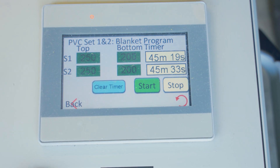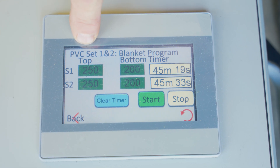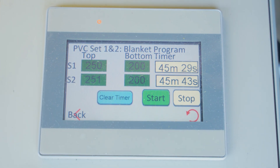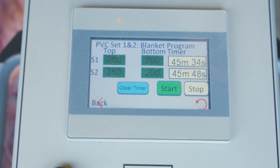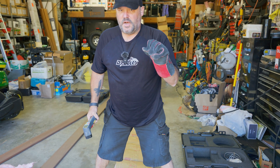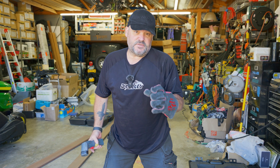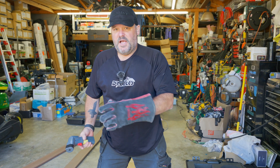I want to show you what the board is looking like. Let's take a digital thermometer and I'll show you the temperature fluctuations from the programmed temperatures to the actual temperatures on the deck board. You can see my top blankets one and two are set at 250 degrees and my bottom blanket is set at 200. Always wear a welding glove or the supplied heat gloves that HeatCon sends with their kit, so you don't burn your hands picking up the board — they're very hot. I've had micro blisters and medium-sized blisters from not wearing the proper gloves, because when you're in the middle of a bend, you're not going to stop to put gloves on — you'll finish your bend and then go cry.